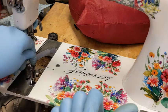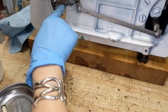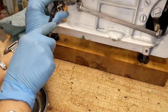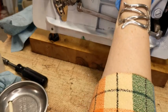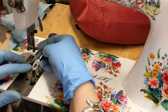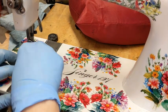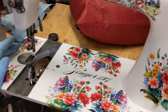So I'm going to go ahead and move this bracket back just a hair. That would be this screw here. Right there. Okay. So loosen it up. Back it up just, not all the way, like midway. Like right in the middle, I think would be good. Okay, let me try that again. Bring it forward. Something doesn't feel right. No, I guess it does. Okay. Let's see. Will it travel? Yes. And it sounds good. It doesn't sound like it's scraping. It's moving really well, so that is good.